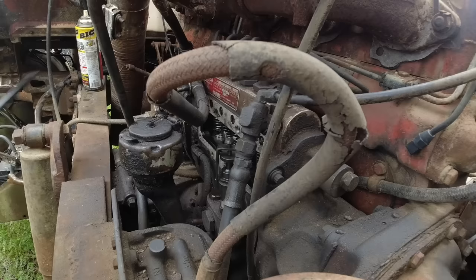So these are the six bolts that we removed that were holding this. We removed 3 bolts from this grease house. I guess that's where you put the grease in or whatever. There's 1, 2, and 3. And then we took this front cover off with the nut. There's a nut on the shaft here, which we removed. So we took the cap off of it. There was 8 bolts that hold the cap on, and then we removed this nut holding the shaft. But when we move the pump, this shaft does not move. So you can wiggle the pump back and forth. The shaft that's coming through the front here doesn't move, but we can't get it separated, so we don't know what to do.